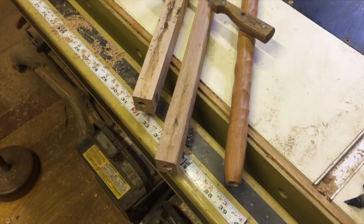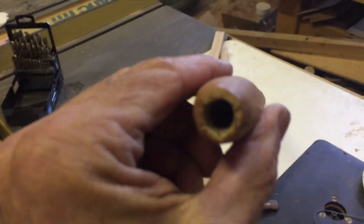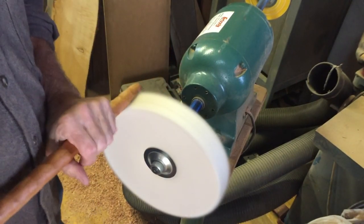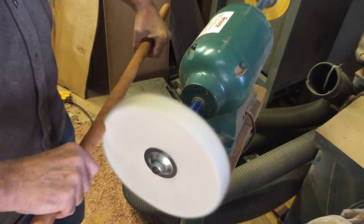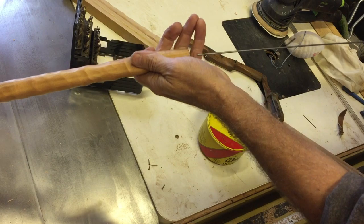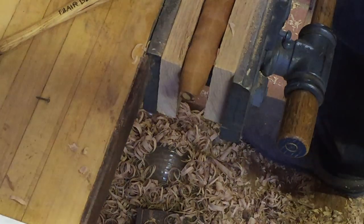This is the finishing point. You can finish it any way you want to. I like using different types of wood oil because it penetrates really well into the wood. These are the different stages — these are all three I'm working on. I chose pear wood. The last thing I like to do is put a coat of wax on it after the oil has dried. You can buff it if you want — I've got a buffer so it goes really fast — but steel wool and a rag works just fine too. My point is there's a whole lot of ways you could do this. I've got this little piece of rod that I run in there because once in a while you get a little bit of glue or sawdust that jams it up — do it from both sides and it clears it out. A quick blow goes through.